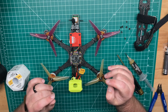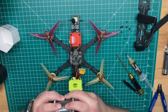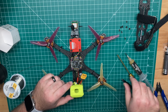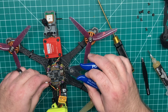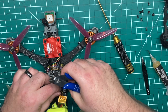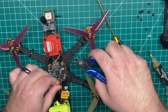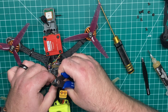I'm just going to solder these three wires up, check to make sure power's on, and then we should be all set. Got the trusty Kester solder — don't leave home without it. The flight controller is mounted backwards, rotated 180 degrees. The three pads you're looking for are the three LED pads: 5-volt, ground, and LED. Let's get these trimmed and tinned. I like to leave some slack. I don't like to leave a lot of exposed wire.